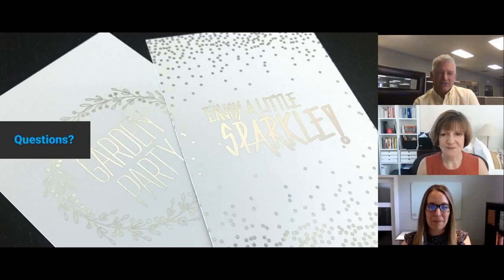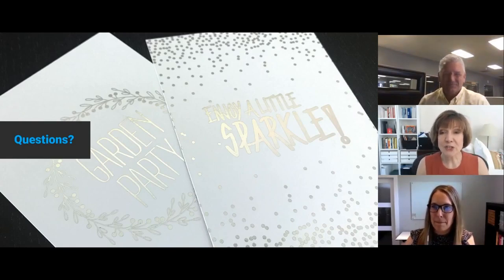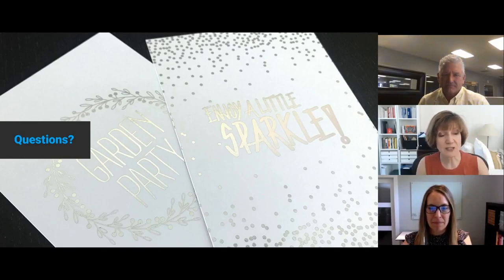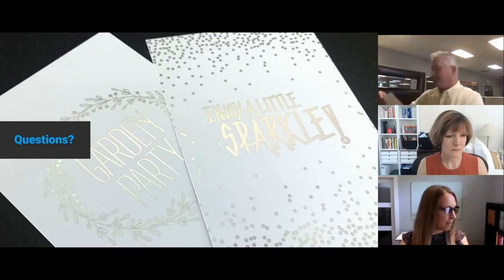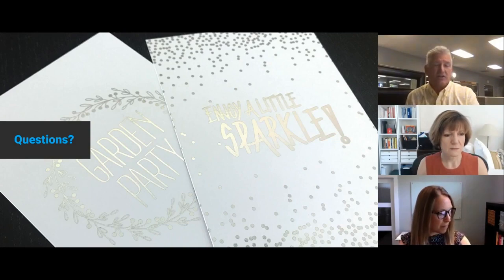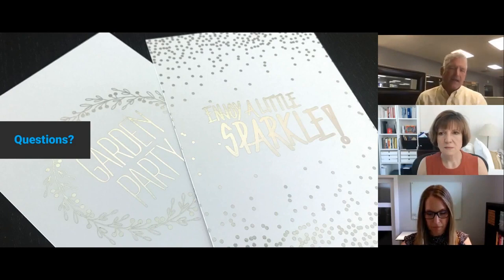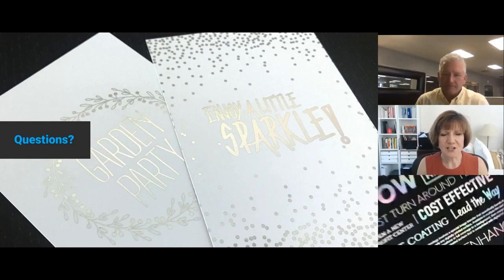In 2014 I asked them why they named it such an ugly name. — We're not getting into this, we have so many questions. Jessica wants to know: is there a minimum size tolerance for sleeking? Traditional foil stamping is sometimes five-point with rules or fine lines. So is there a minimum? Well, the poster you saw of the night sky had extremely tiny stars. However, I wouldn't want to do that in type. It depends whether it's a serif or a sans serif font — a sans serif you could go a little bit smaller, but with a serif they're going to disappear or pick from the sheet. Five-point type would scare me, but it would depend on the design.